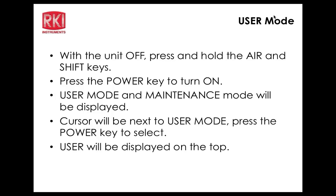Okay. I'm going to start measurement again here. All right. So right now you notice that I'm at normal mode, and it says mode select normal. If I use my up or down arrow keys, I can select leak check mode, because I activated leak check mode in this instrument earlier, so I do have the opportunity to do that when you start it up. All right, so we'll just go back to normal mode, and then it's going to go through its various diagnostics at this point, but that's not what I want to do right now, so I'm going to turn it off, and we're going to go into maintenance.